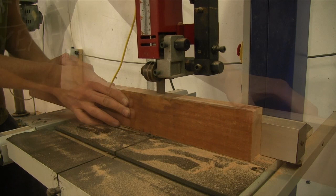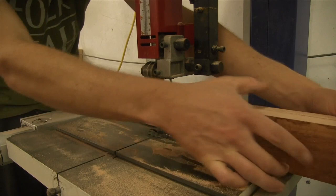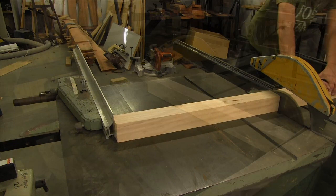The second step is preparing the leg blanks — the core material for your legs — ensuring that it's nice and square and then trimming it down to an oversized length of about 750 millimetres. It's also a good idea to try and get quarter-sawn material for your leg core because that will be the most stable material you can possibly use. The third step is the glue-up, which is broken into two halves.